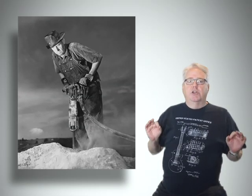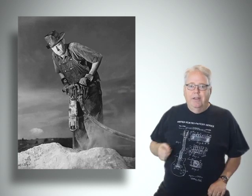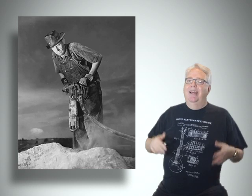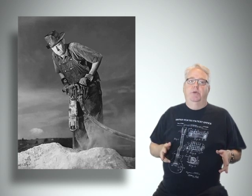What is tool deflection exactly? Picture your cutting tool being hit repeatedly from the side by a jackhammer just like that one. Suppose you've got a three-flute cutter running through a cut in aluminum at 10,000 RPM — that means the jackhammer is pounding your cutter 30,000 times a minute.